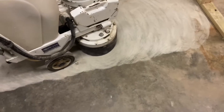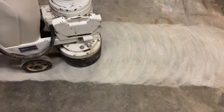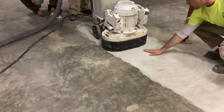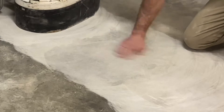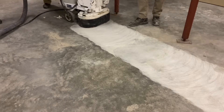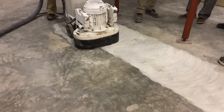Running at half speed minimizes the heat created from the friction of the tools crossing the surface of the concrete — the cooler they stay, the more freely they'll cut. Because this concrete scratches between a 7 and an 8, experience says it will only be a matter of time before the diamonds start to glaze and cutting slows down.